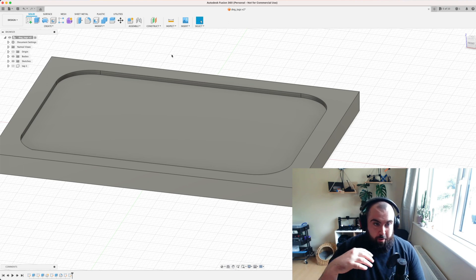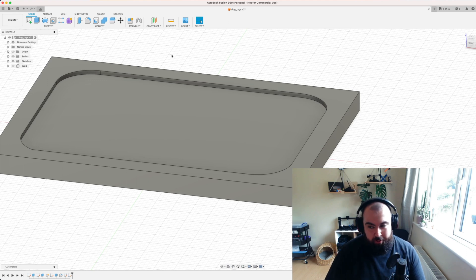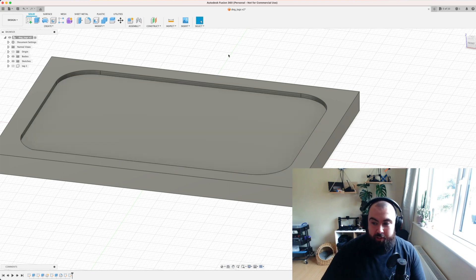It's a very simple fixturing technique. On a proper CNC machine you'd put down a spoil board as the very first operation and get it to cut the entire surface level so everything is perpendicular to the tool head. I haven't done that — the machine isn't really capable of milling out a huge area very flat — so this localized perpendicular spot should do the job.